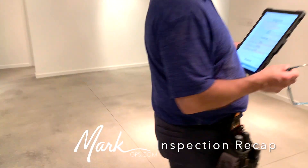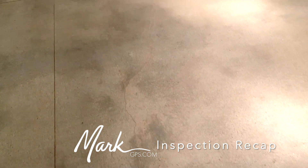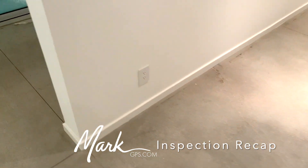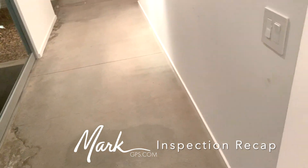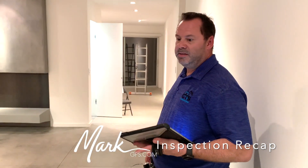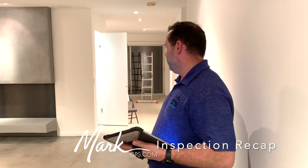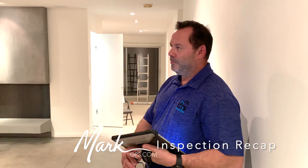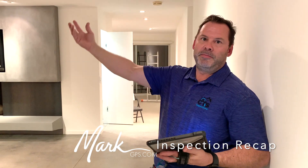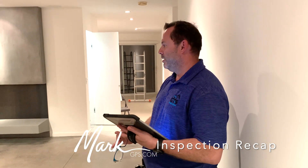There's a hairline crack in the flooring — not a big deal on its own — but that crack goes under the wall and continues on the other side, indicating it's one continuous slab, which is the original foundation that was polished and scored over the years. The chances of electrical coming up from below are pretty small since wiring goes through the framing — through the ceiling or walls — not underneath the slab, as it can't be made moisture-proof that way.